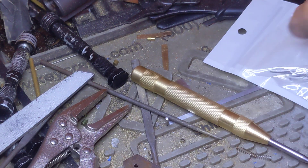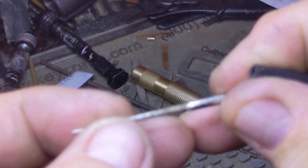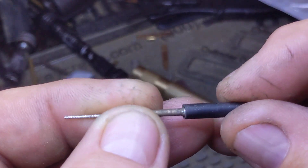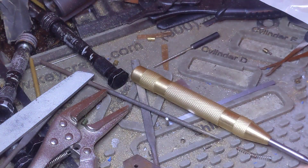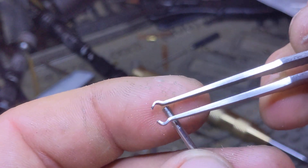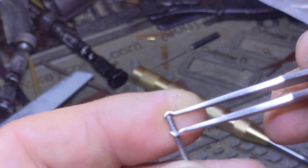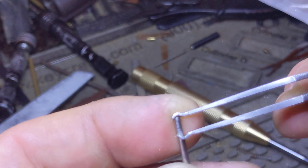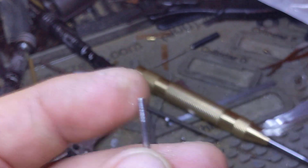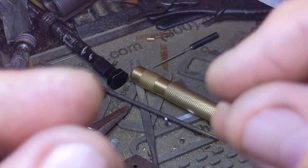I'll take a three millimeter outer diameter and a two millimeter inner diameter brass tubing, find this little thing right here, slide that off, put that in my Dremel bit, and pretty much run that brass disc up to this point. That lets me know it will slide over the stainless steel tubing. When I cut off a piece, it just takes a little bit of messing around until you get the actual length you're looking for. I'll leave one end square-cut and the other end I will take a file and round it off, which allows that wafer to come off and slide back onto the tube.